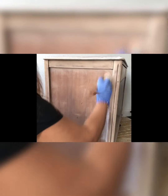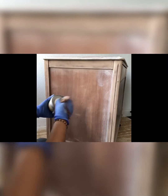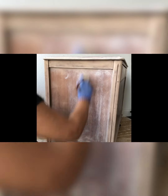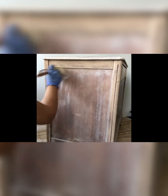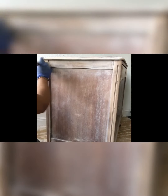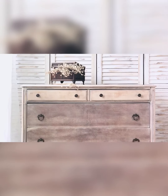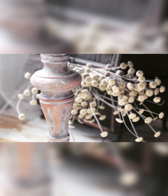Make sure you're wiping the wax off completely. I did the second coat with the white wax on the entire furniture — the wax settles into the details on the wood and enhances the color completely. Dixie Bell waxes are water-based so they can be sealed with a clear top coat or clear wax once dried. If you use an oil-based wax, that is a sealer in itself and doesn't need to be sealed again, though you can add a clear wax for extra protection. Once done with the whitewash look and coat of clear wax, this is how the piece looks. Hope you enjoyed the video, thanks for watching!